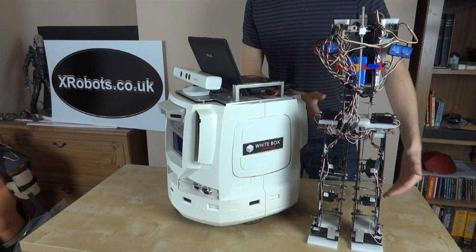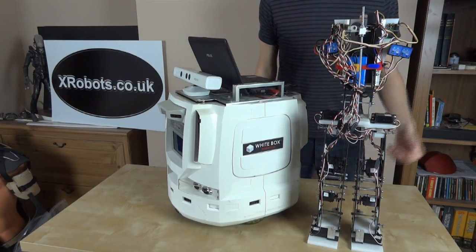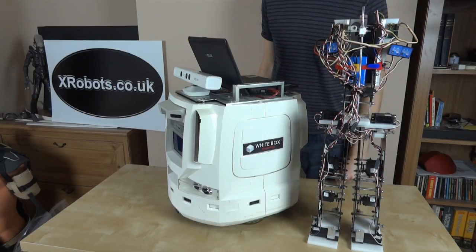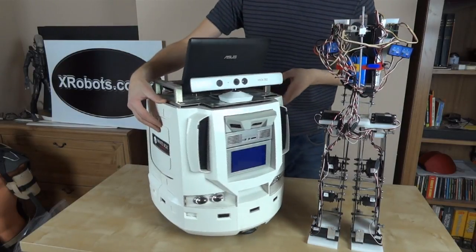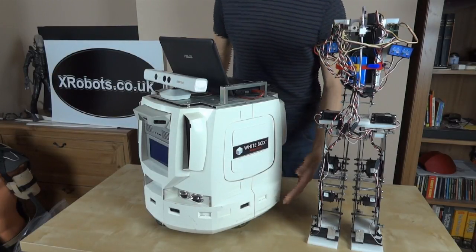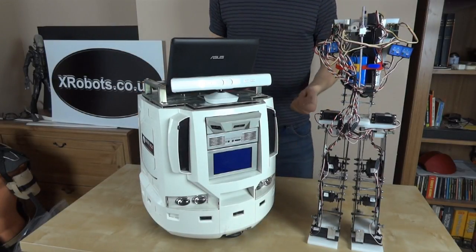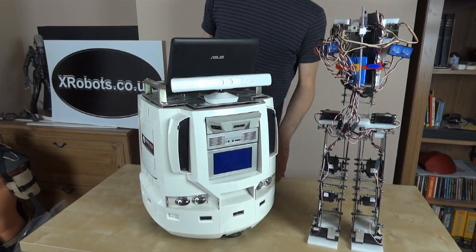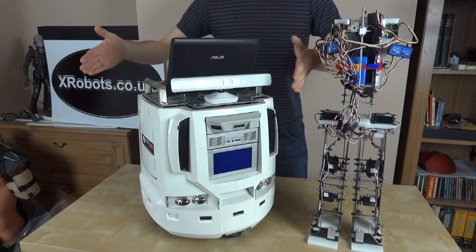If you want to see Android 11 or any of my other robots in action, there is a YouTube playlist in my channel called robotics. There's also a build blog on the website for Android 11 and two testing videos — it's also been featured on Hackaday and a number of other blogs. My approach for this robot is similar: the wheels are driven by stepper motors, which means we can count the steps to work out where it is and make it rotate and drive specific distances. With a SLAM algorithm generally you'd read sensor data and modify the position simultaneously based on obstacles.